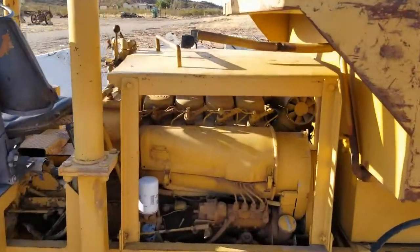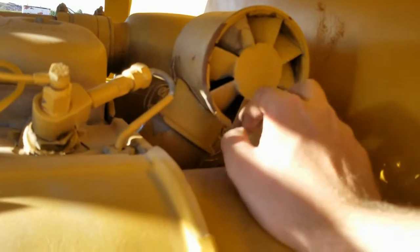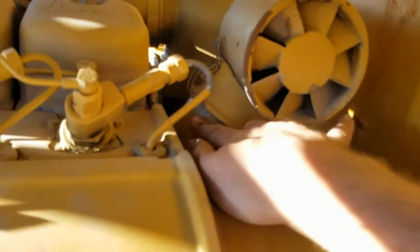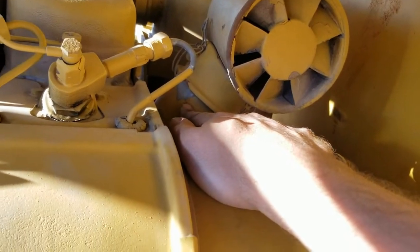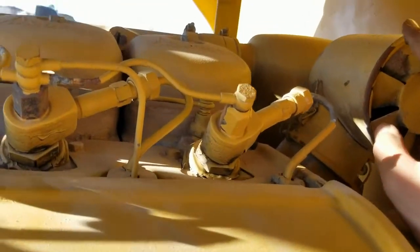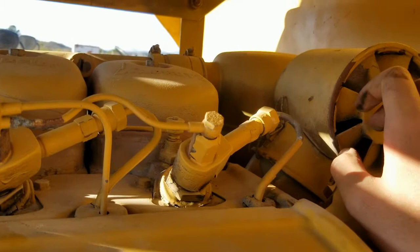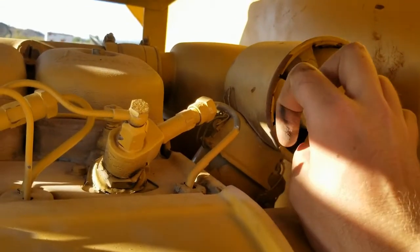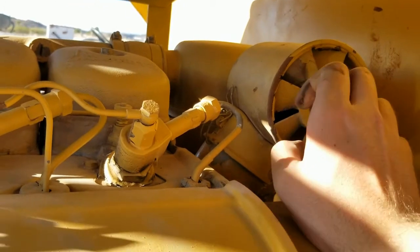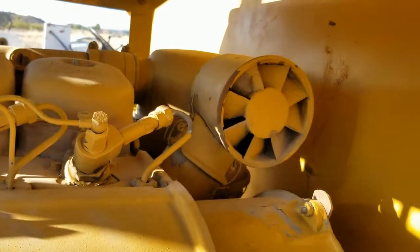Now, one last thing. This is a centrifugal air cleaner. There's a bowl in there that accumulates the sediment. It's a sediment trap. Then that feeds into the oil bath air cleaner. An air bath oil cleaner, while interesting, wouldn't make any actual sense, but I do say that a lot out of error.